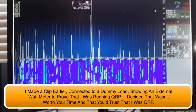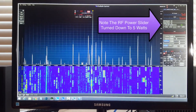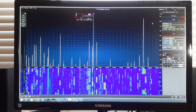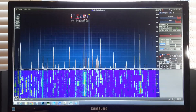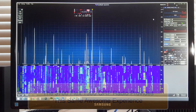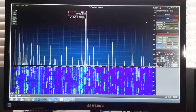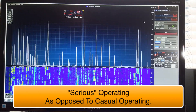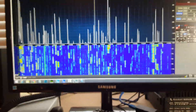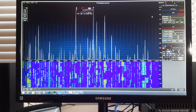You can see the contest running — this is the 20 meter band, and what you're seeing are a bunch of stations all working this contest. By looking at the screen you probably know why it's my choice to run QRP with a Flex 6300 — it's really hard to beat that giant pan adapter. I still love my small QRP rigs like the Mountain Topper, KX1, FT-817, or KX3, but when you're serious it's hard to beat having this giant pan adapter and the ability to grab the filter with your mouse and change the width of the passband for the signal.